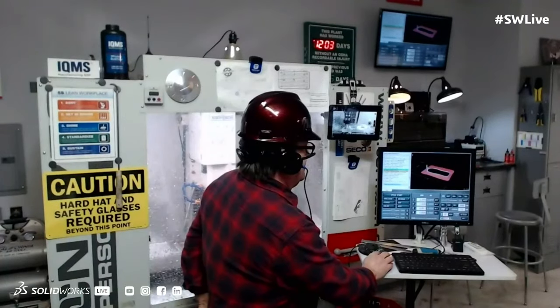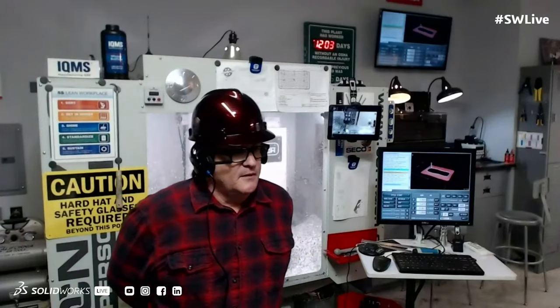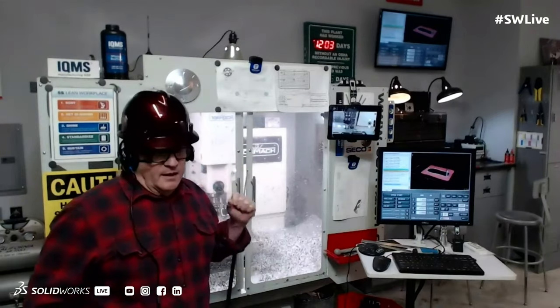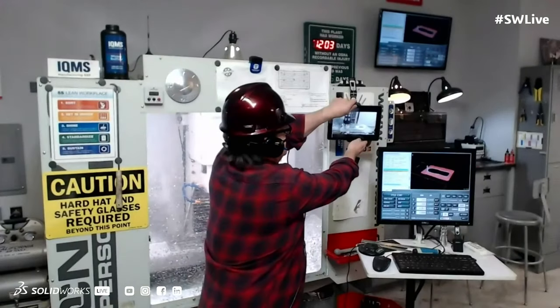Michael actually, what he did was he ran it through a post-processor. And the post-processor takes the cutter location data that's generated in DELMIA NC. And what it does is it converts it to G code specifically for this machine tool here. So it's custom tailored specifically for your environment then at that point. Yes, it is. All right. And you can see here the resulting tool paths.